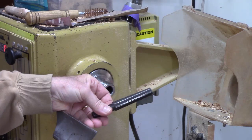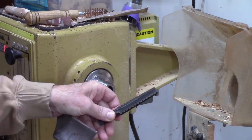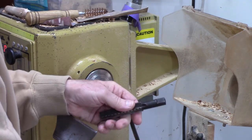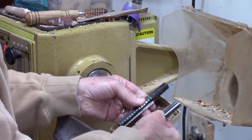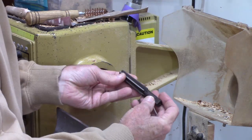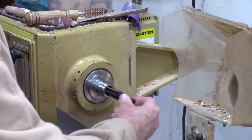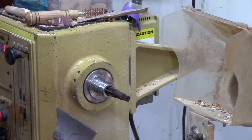Machinists use what are called reamers — in some instances to cut a Morse taper. They'll drill a hole first, and then use this precisely machined taper. This is a coarse reamer, a number two Morse taper — I bought these as a set from eBay for about $14, supposedly high-speed steel. For minor damage, I would use the reamer with the straight smooth edges. This is where you would use some type of cutting oil or lubricant in there, and then turn it very precisely on center.